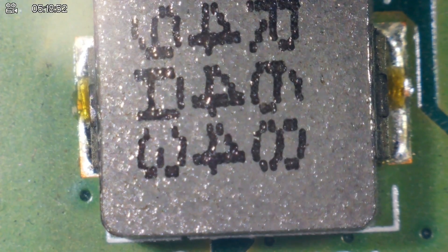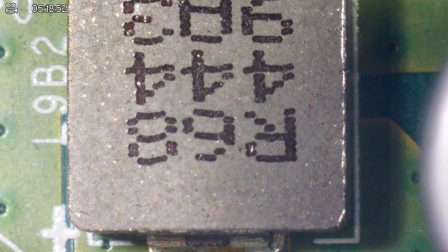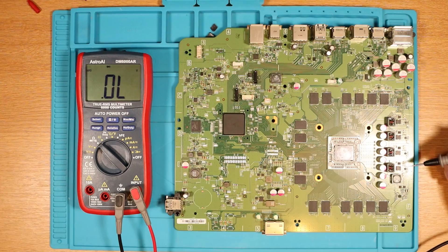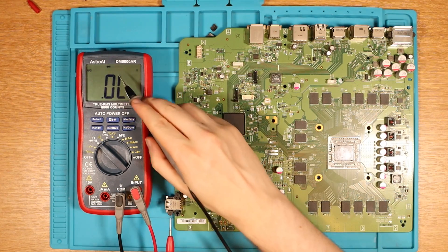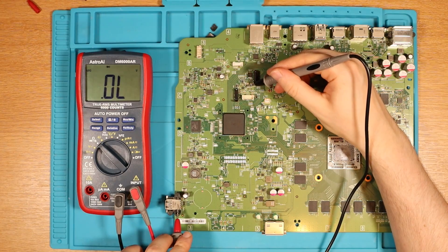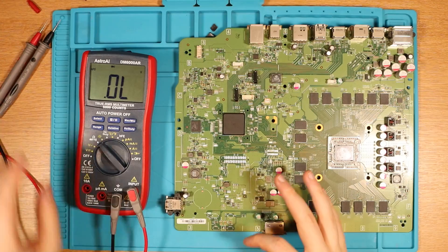I'm going to check the coils around where the power comes in. That seems to be fine. Move to the next one down — that seems to be fine. Next one down — that also seems to be fine. So now that I've tested the power rail there's one other MOSFET. I've got the multimeter in diode mode, red probe on ground. I want to check this gate here and it should be 1.9. Yeah, we get 1.904 volts, which is good — that's what you want to see.